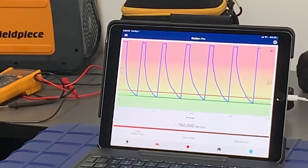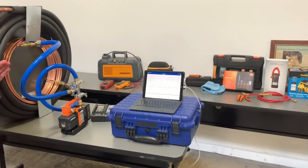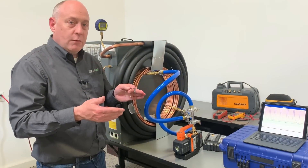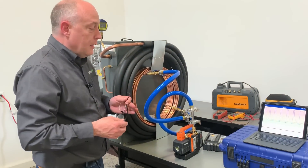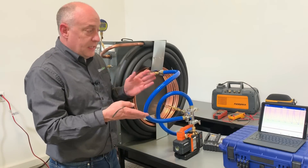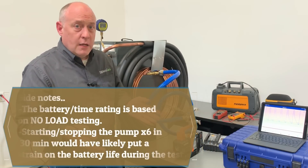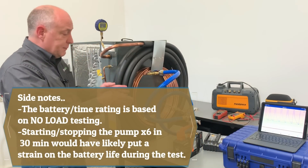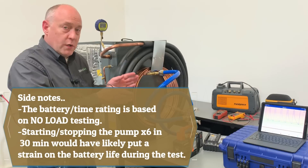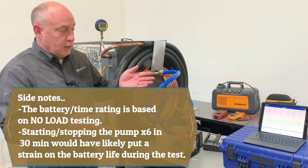Now, what's interesting is it does have a solenoid in here that clicked. If we were actually part way down in a deep vacuum, what would have happened is that solenoid would have dropped, and we would not have lost our vacuum very quickly. The battery is fully expired here. But if we did six pulldowns on a day on our job, that would be a lot. And the only reason this is all possible is because we've paired up the 2 CFM pump with the True Blue hoses. If we weren't using True Blue, it would take us an hour to pull down the system one time, let alone six times.